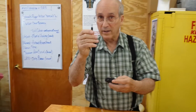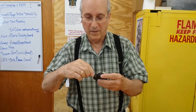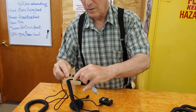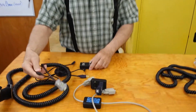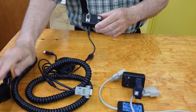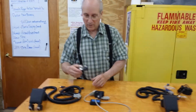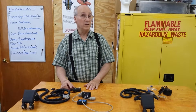and it even has a power jack that will provide 9 volts from the computer's USB port to the scanner. You would use a mono plug — not a stereo plug, as that could damage the device — from here into the power cord for the C3000. That allows you to run directly from your laptop at a screening and not only work the scanner but also power it. This device is workable even up to Windows 8.